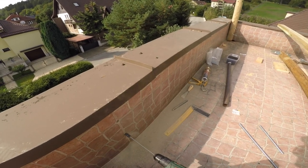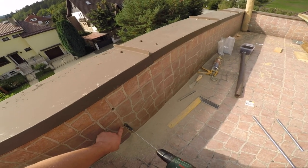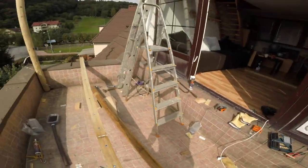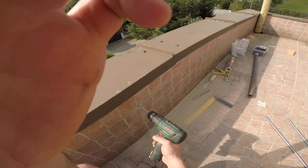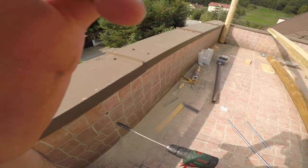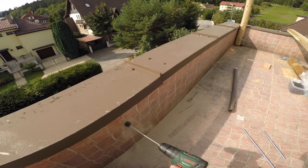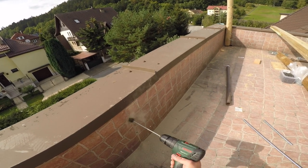The same for this hole. On this hole I struck some hollow, so for hollow stuff I've got these wall plugs. I'll show them to you in a bit. So keep doing this until minimum dust is coming out or no dust. When you're done with the little brush, put the big brush in. The more dust you can take out, the better. It's going to adhere to the hole.